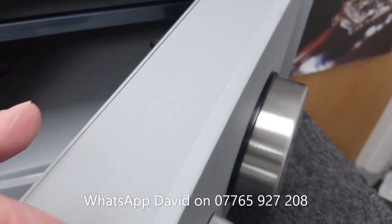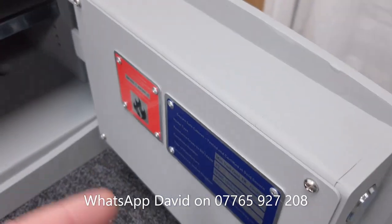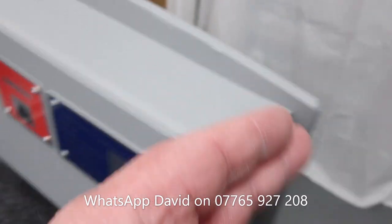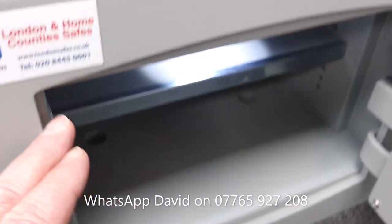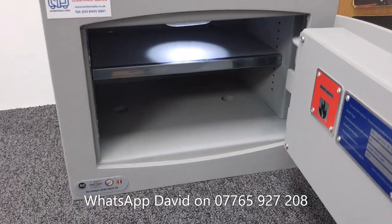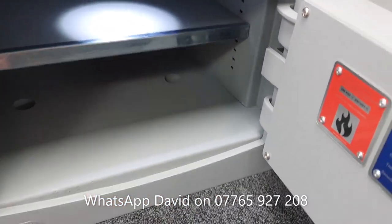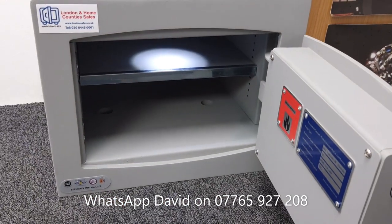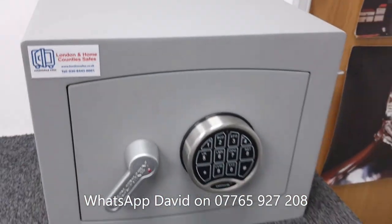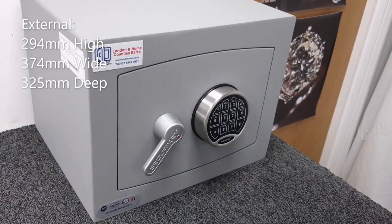The door plate thickness is eight millimetres — not the thickest but quite adequate. It is an anti-bludgeon door: the door edge recesses all the way around on three sides. If you try to smash the door inwards with a sledgehammer, it'll have that protection of those recessed edges pressing up against the frame, making it very strong.